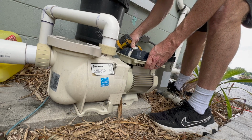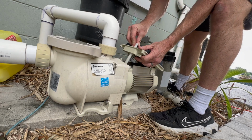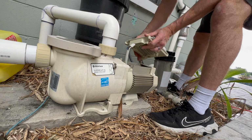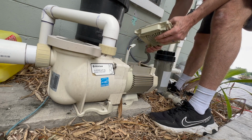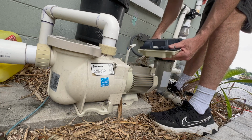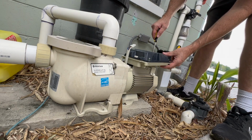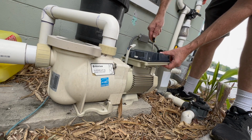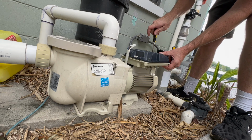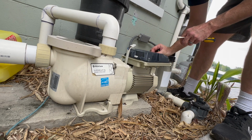And that loosens it up, as you can see there. You're gonna have to run this out. There's plenty of space here. So we're just gonna kind of squeeze that through. That comes straight up through the top. Okay, then all we have to do is unhook it from the power. Our power's already off, and I've already unhooked the connections there, so I just gotta go ahead and pull it out of the conduit. Ground, which is still connected.